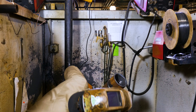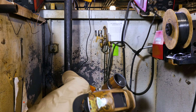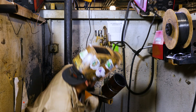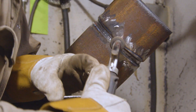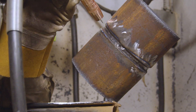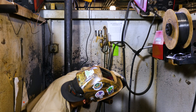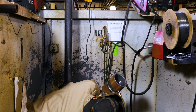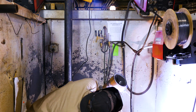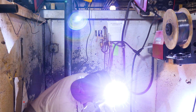With the 6g, you kind of want to size it up — it's a monster. You don't want to just step into the ring without knowing what you're getting yourself into. What I do is called a dry run; I make sure I'm comfortable through and through, all the way to the top. I feel pretty good about that, so I'm going to drop the hood and get to burning, keeping that puddle away from the beveled edge so we have our guideline.